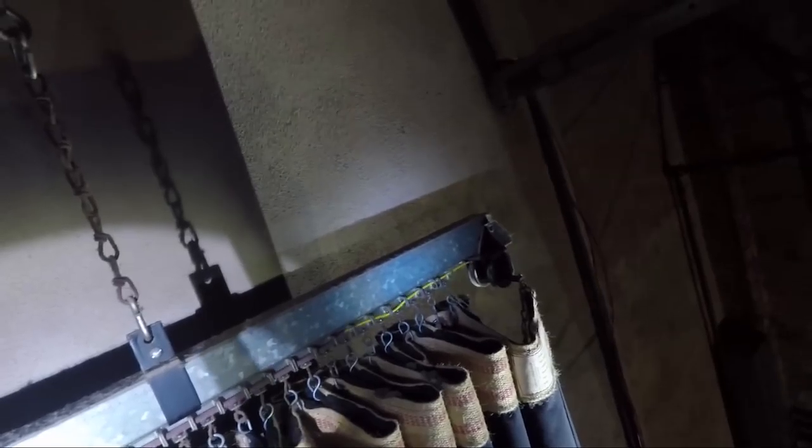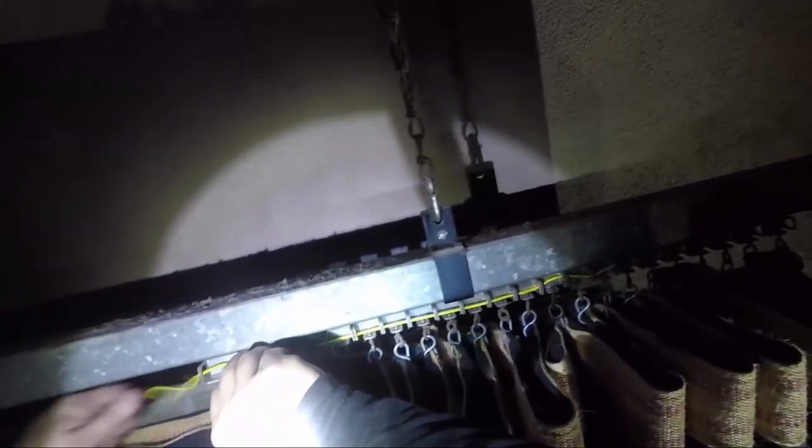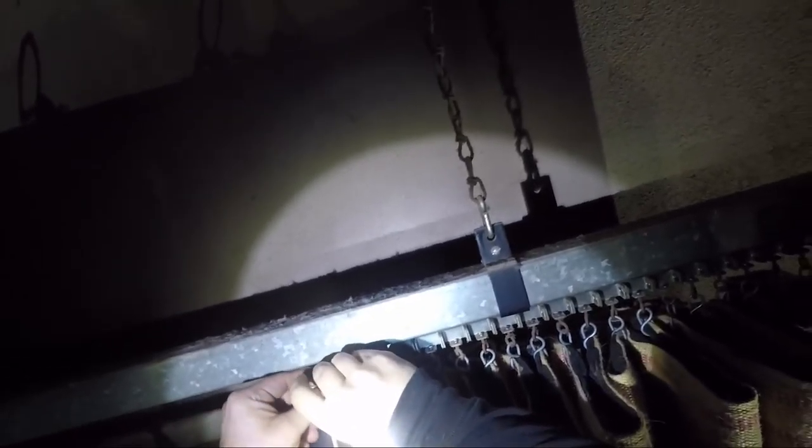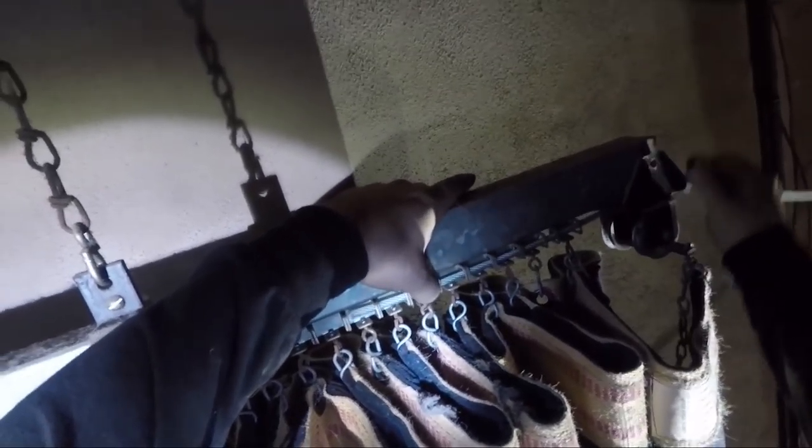Fortunately I was able to use the old cable to fish the new cable through. Right here you see in yellow that original high-strength steel cable. The cable goes through each of the carriers that hold the curtain, and that's one of the reasons this has to be done pretty slowly and meticulously — if you get one of those off, the whole system will bind.